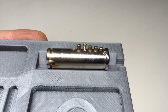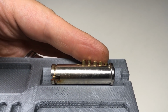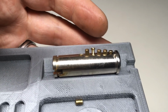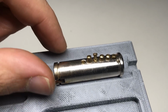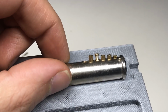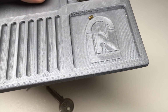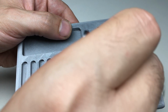Okay, so I gutted one side of the lock, and you can see that there are spool pins in chambers 1 and 4, and they do activate. But have a look at chamber 6 there. You can see that the pin is so long that it almost reaches the top, but not quite. So you'd still need to sort of half pick it. Now actually have a look at the driver pin here. And look how round the ends of that driver pin are.